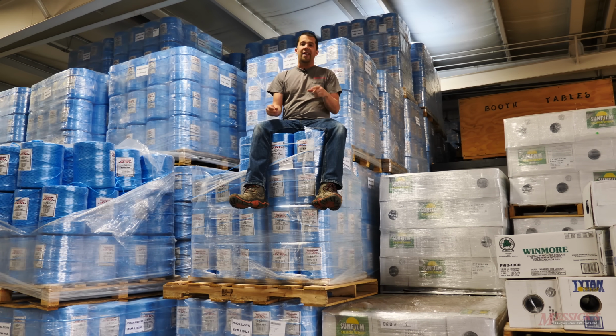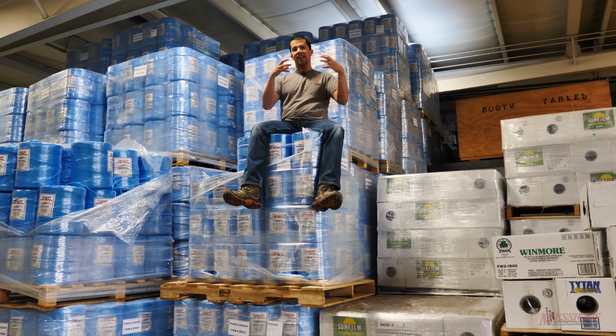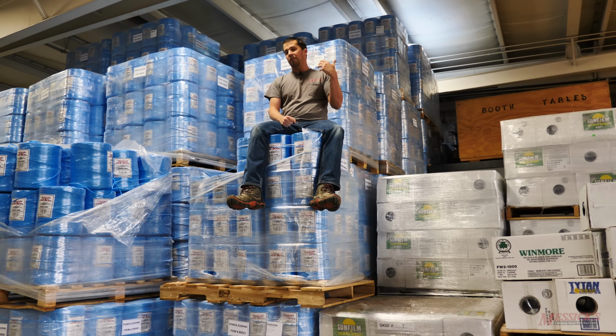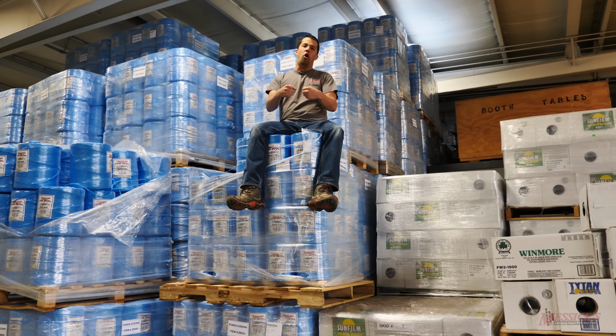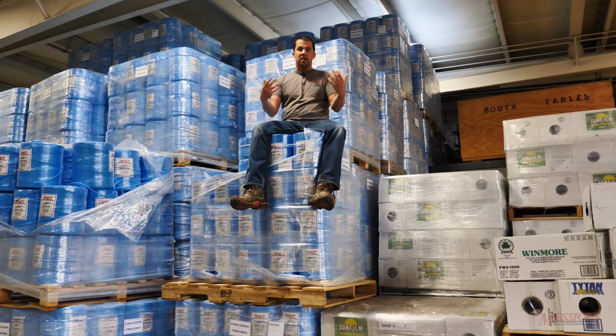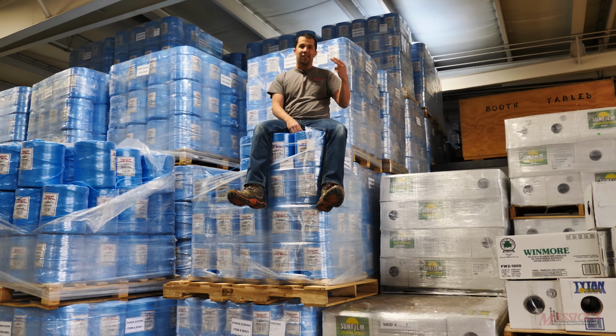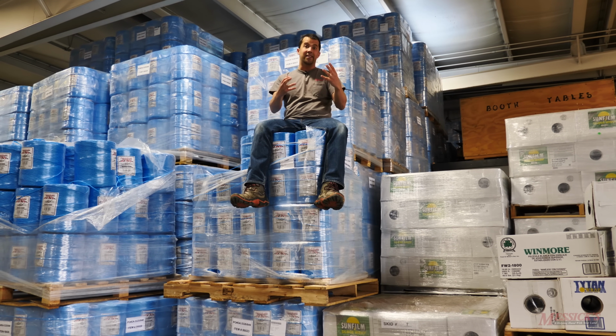There's a trade-off there. The heavier knot strength you get, typically the thicker the twine is, and therefore less of it in a bale. So if you're going to be out doing a lot of bales, you're going to be changing more often by running that thicker, heavier twine, but you're a lot less apt to have the bale bust open out in the middle of the field, costing you time to clean it up, product that you could be selling, and a lot of headaches in order to get things cleaned up again.